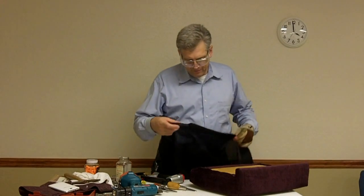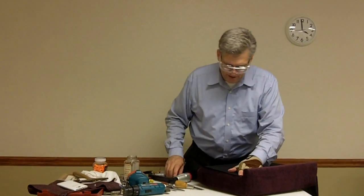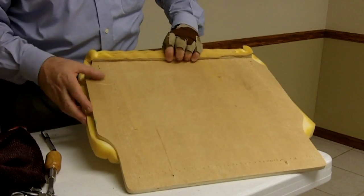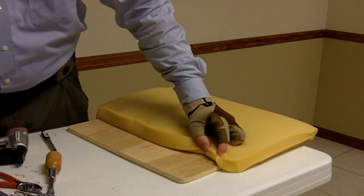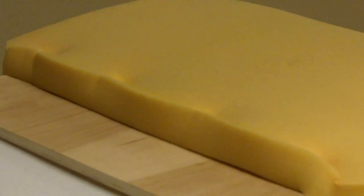Typically you'll have black cambric cut for the job — just tuck it in place; it doesn't have to be too precise. Now we're going to do the back. Check the back pieces — they're in good shape and the wood is fine. We've had a mark put at four and a quarter inches from the end, marked several times across the piece. That's an important measurement for our fabric. We've also had a sew line put on here.